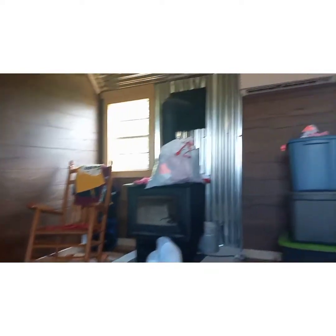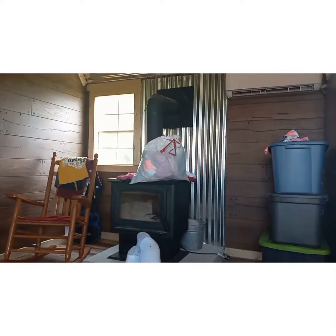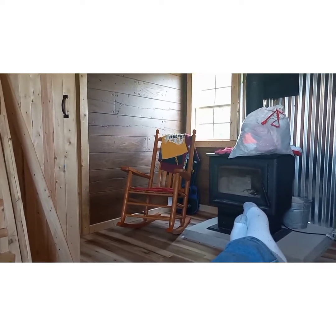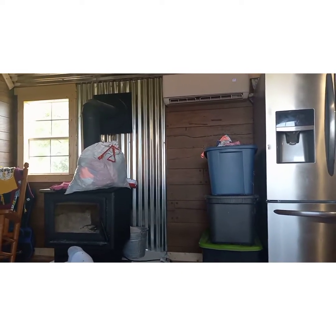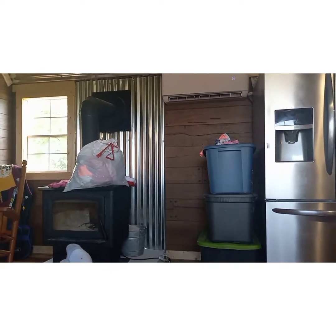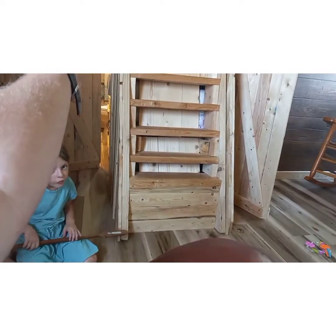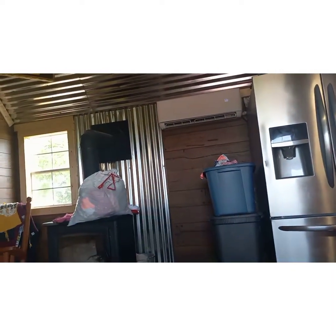But like I said, there are no vents, right? This is a ventless system, so the air has to move naturally, and it just doesn't naturally want to go in there. Now, the bathroom does just fine. I think the reason is that the air is blowing directly here, and I'm sitting in the recliner right now. It feels like there's a pretty good fan blowing on me, a pretty good chunk of air hitting me. I think what's actually happening is it's hitting this back wall right behind this chair and then running air back into that bathroom. So I wanted to let you guys know why I think our bedroom is harder to cool.